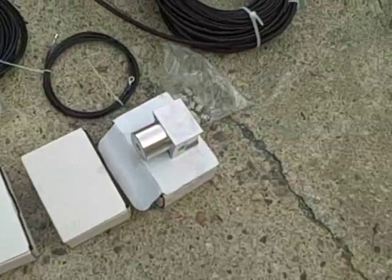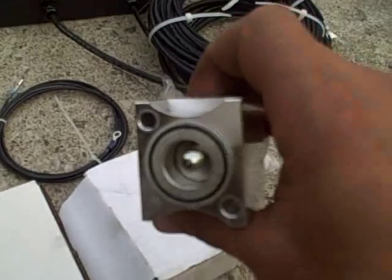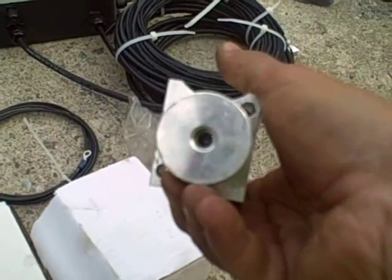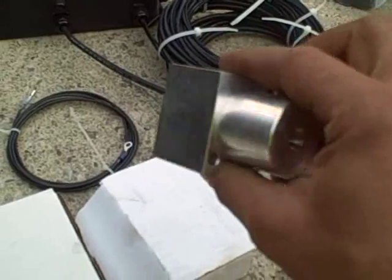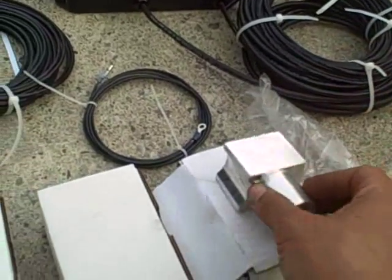Here's what the valves look like. These are custom machined in-house to bolt right on. Basically you just remove the cap and the spring from your existing spool, bolt these in place, and there are ports on the top and on the front for the air actuation.